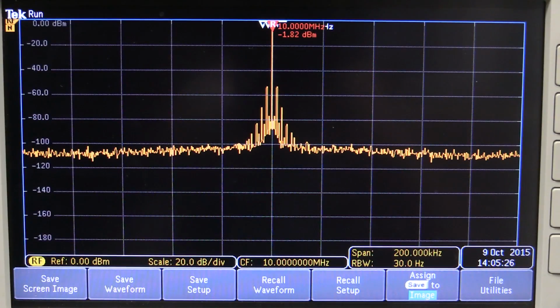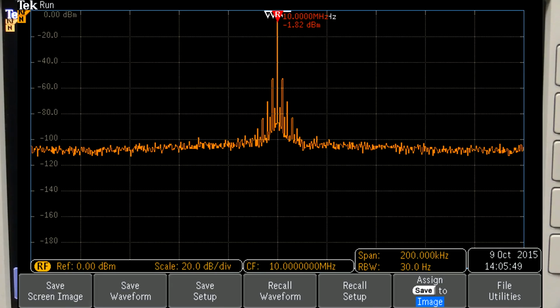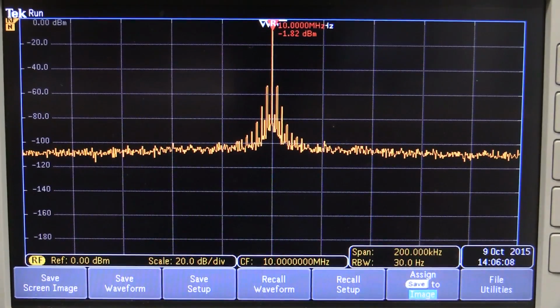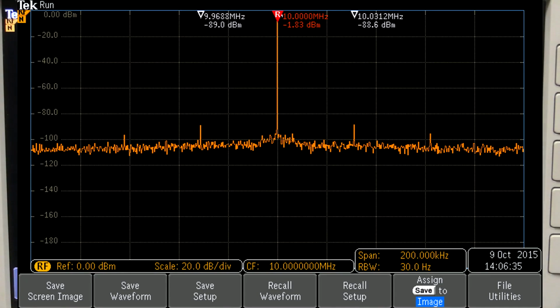And that's the exact same signal on the Siglent SDG5082, the 5000 series. And as you can see, not nearly as good as the Siglent X series. Look at those sideband components. Wow, they are massive. So remember, that's a 14-bit converter compared to the 16-bit in the X series. But geez, well, let's take a look at the Rigol now. And there you go, that's the Rigol. I'll just save that, take a screenshot.